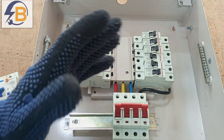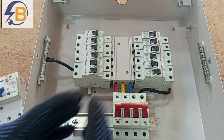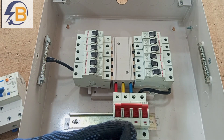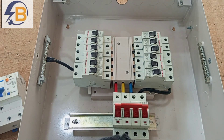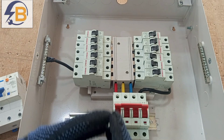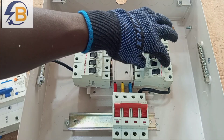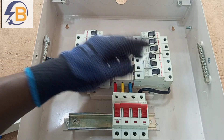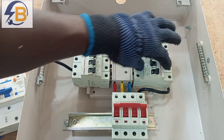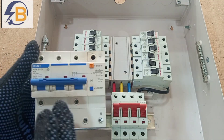That is why it is always advisable to split the circuits into two or more groups and protect each group with an RCD — for example, grouping all lighting circuits, all water heaters, and all air conditioners separately, each protected by its own RCD. That way, a fault in the AC circuits only trips the ACs, and the lighting and sockets remain working. Another alternative is to use RCBOs to replace the individual miniature circuit breakers — for instance, replacing a 32-amp breaker for a water heater with a 32-amp RCBO.